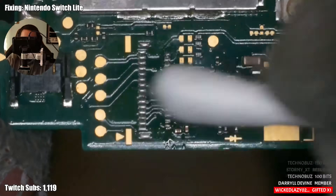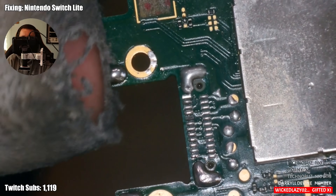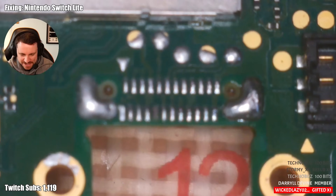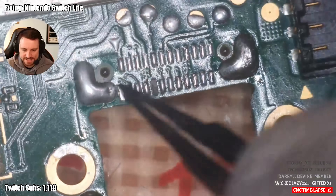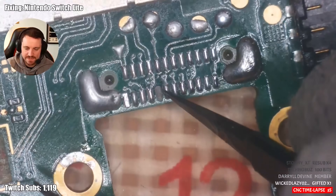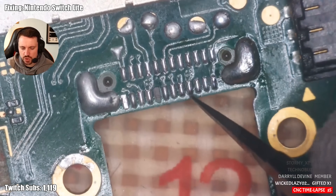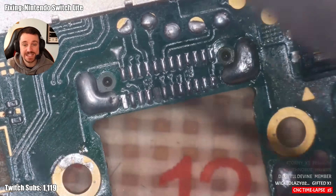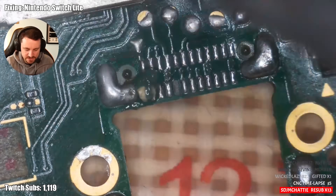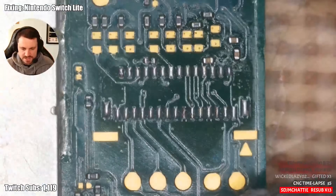So we've removed the connector now. We're going to add some flux and go ahead and add some leaded solder to these joints, then clean this area. Happy with that. Port's ready to go as well. Let's go ahead and check if this is a ground pad — yeah, look, it's a ground pad. So I was looking at doing a trace repair here but I don't need to. This one here just doesn't have much solder on it; it's connected to ground, but we've got enough ground points here. Obviously the one that's ripped, but we don't have to worry about this ground pad. I've just added a drop of flux here as well, just to put a little bit of solder on that end pad. All four ground pins need to be there. So that's ready to go and we can just replace the connector.